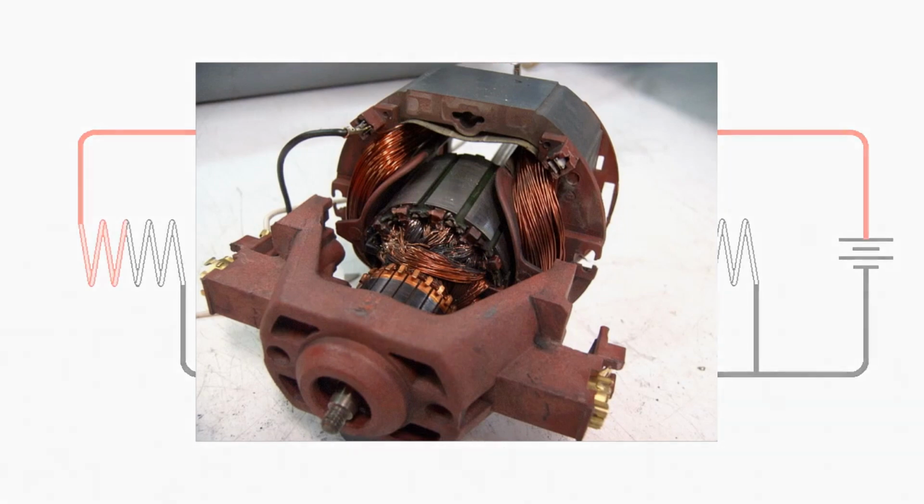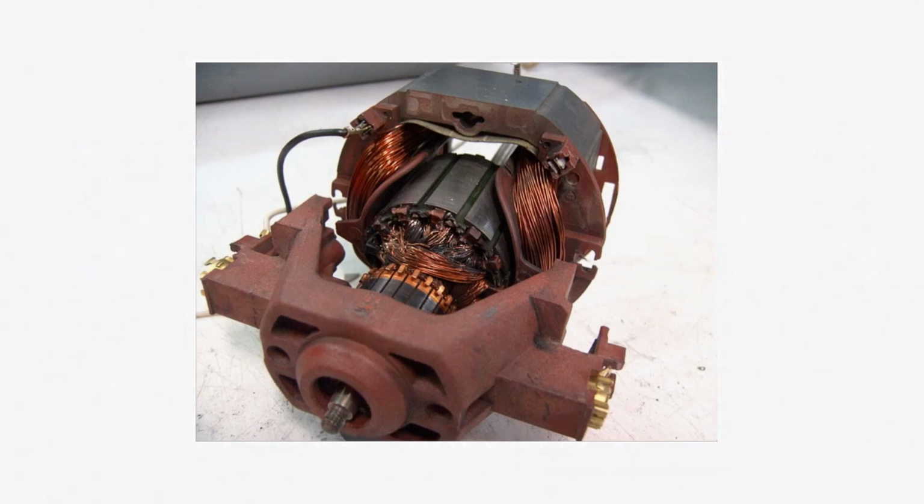Once again, here's a universal motor, so this would be a series wound electromagnetic motor. So you see the windings for the field coils and the windings in the armature, and we see there are many poles in this one because it's a bigger motor, and so the more poles we have, the more efficiency we have, because the poles that are not in the magnetic field aren't doing anything. So let's only put power to the poles of the armature that are in the magnetic field, and so bigger and bigger we end up getting more and more poles, and then we have the brushes connecting to the commutator you can see here doing the work that we showed, but just more poles than the 2 or 3 we've been showing.